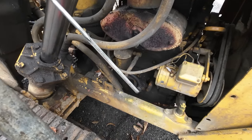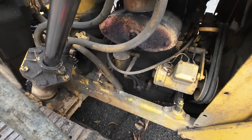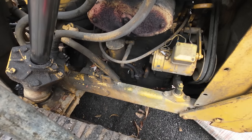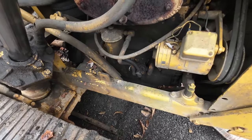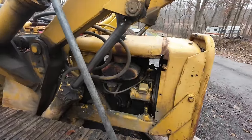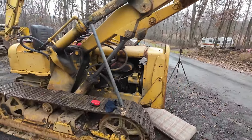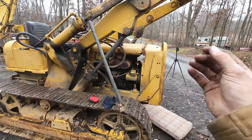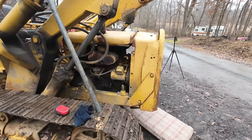As you can see, we just dipped our oil pan here. We're way over full, and it smells like old varnished diesel. I swore we checked that whenever I picked this thing up, and it looked okay, but obviously not, because it sure didn't just happen overnight here. With that injector line that we fixed being cracked, I don't know when that occurred, but there was tank pressure there. So just sitting there with the line off of it or cracked, it could have been allowing fuel to slowly drip down and fill up the oil pan.